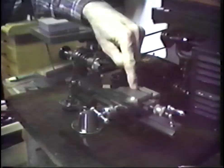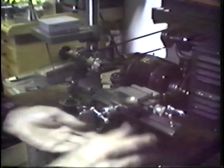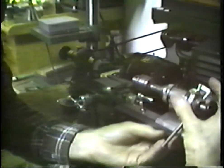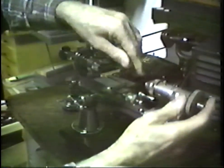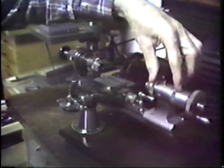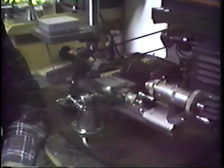We have the cross slides both directions, and the tool post. I don't have the tool post in hand, but we have a tool post that mounts here, so we have that facility. We come down to this, which is a lever tailstock, and in addition to that we have the tailstock here, which is a micrometer feed tailstock, also holding collet holding. And in this there's a micrometer barrel. You can use this for controlled depth of press, though I have never used this as such.